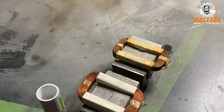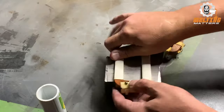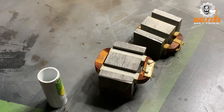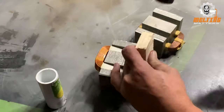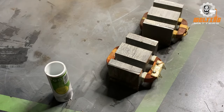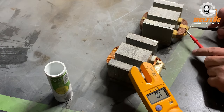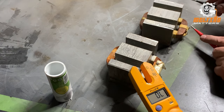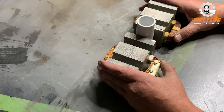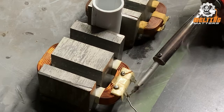The next part of the project is refitting those primary windings back into the steel cores. This one was a little bit wider — I ended up reinforcing the paper around it as it had a couple of tears, and I wanted to make sure I wasn't going to damage the laminate on the copper windings. Before epoxying it all up, I'm checking that the windings have good resistance and aren't shorted to earth. The first transformer measured at three ohms and the other at two ohms — pretty low, and neither was shorted to earth, which was lucky.